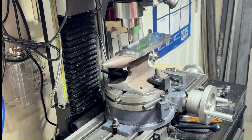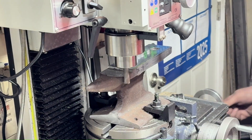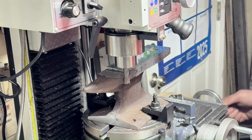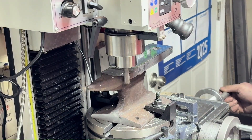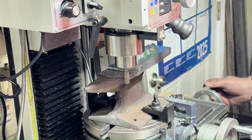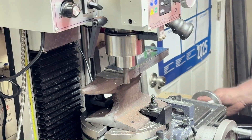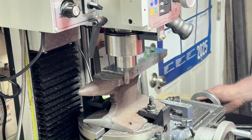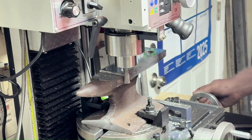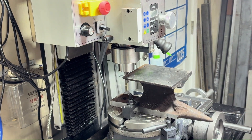Next is the taper part on the rotary base, and I think it's about two to three degrees on both sides that I cut in, just to follow the material that was already there. I did not really want to go all the way from the very back of the anvil and take off a few thousandths all the way down just to make the whole thing flush. So I decided to just taper the front in. The table was squared to the slots on the table, but that slot was just slightly off.